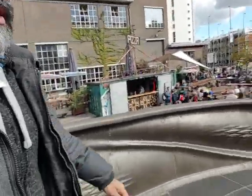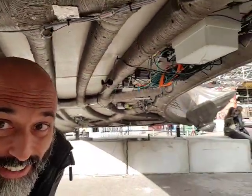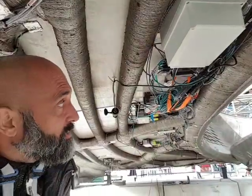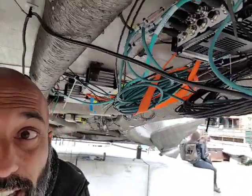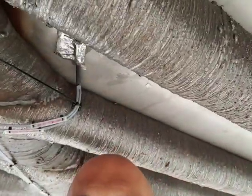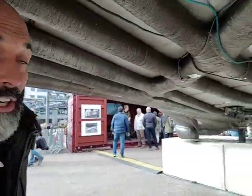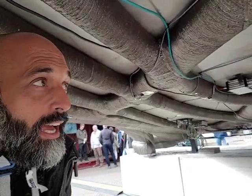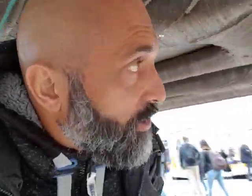Let's come off this side of the bridge and go underneath to take a look at some of the stuff going on under there. Here we can start to see some of the wiring and the smarts that have been added into the bridge. There are various boxes, cables, and sensors — for example, up there we can see a sensor built inside the structure. We have strain gauges, accelerometers, and temperature gauges, and all of this is streaming right now at about 10 hertz — 10 readings per second. We can go much higher but for now, baby steps.